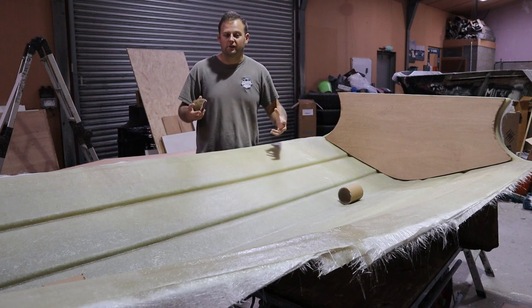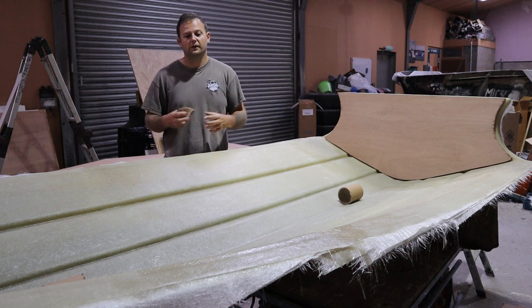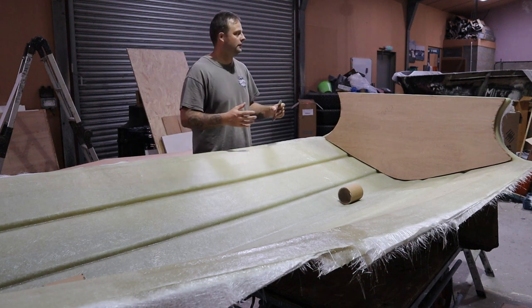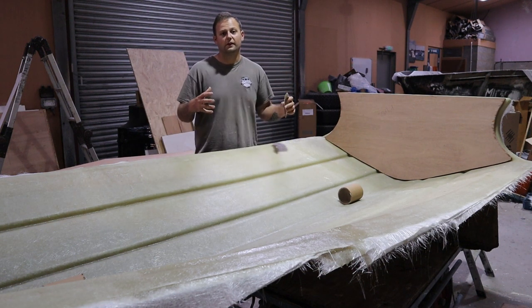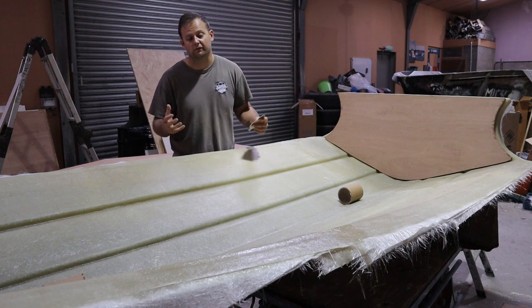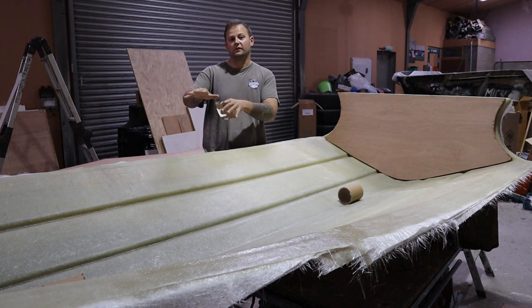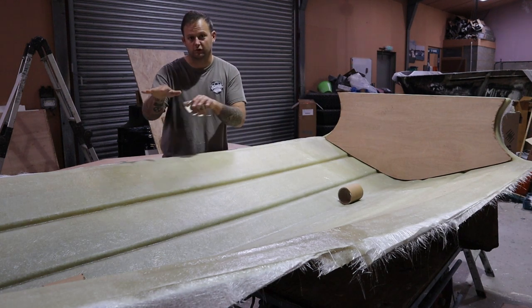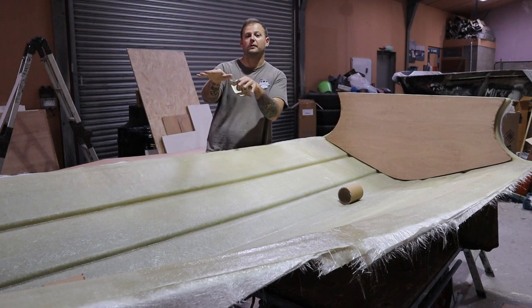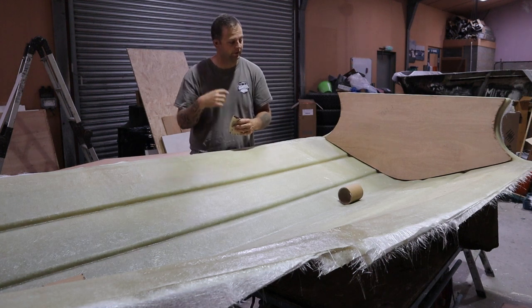One thing to consider when you're making a mould is twisting, distortion, and things like that. Normally, if we're building a larger hull with the 21s, we'd put all the framework in first, the longitudinals, the bulkheads, all the stiffening, so that when the hull comes out of the mould, you're not going to get any twisting or deformities in it. If you put it on a trolley slightly twisted and then build everything else, the boat is just going to go round and round in circles, okay?